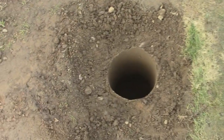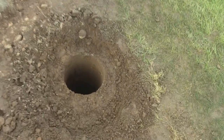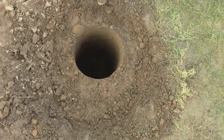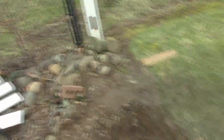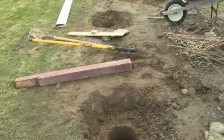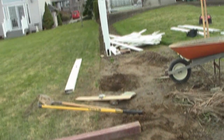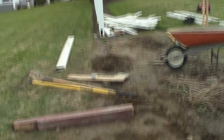Is that a post hole or is that a post hole? I've done both post holes. If you look closely, you can see that indentation around the hole — that's the four inches below grade so we can put dirt above the concrete to plant grass or have decorative gravel without exposed concrete. Let's mix some concrete.